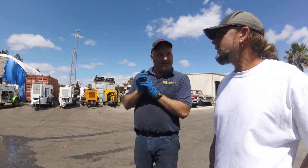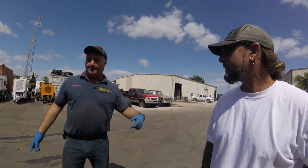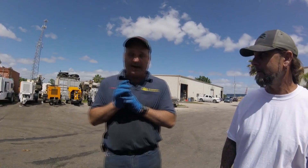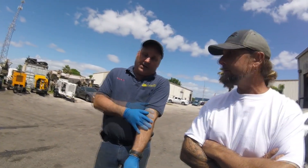Remember Apex? Country Coffee? That's what blew them down. A pump got loose, snagged a lady through a toll booth — she was handing out money and it went through and killed her. Put the whole company out of business. They had 50 trailer pumps running at once, dominated Orlando, but that one incident with no breakaway switch took them out. Just make sure the switch works. If you see the wires pulled out, be aware — if the wires are disconnected, the brakes engage and you'll feel it pulling you back while driving.